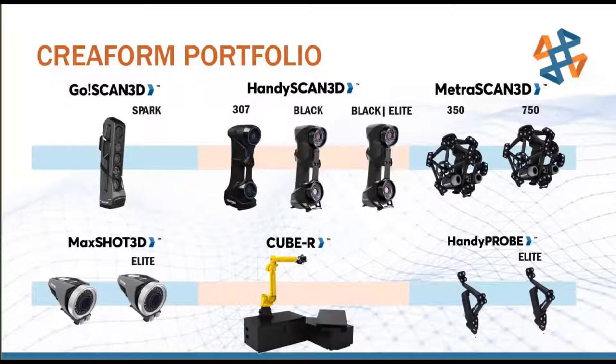How it's very different from a CMM is it's a wireless probe. So we're not bound by any XYZ constraints of the frame of a CMM. We can really go a much larger, more flexible volume with this system. And when we hit this later on in the slides, I'll explain exactly how that works and how this can be a wireless system. Very, very accurate single point data.